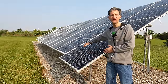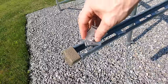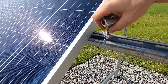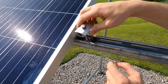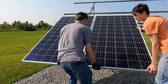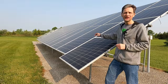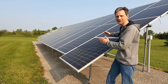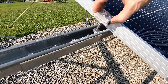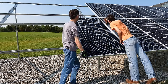To start setting your panels, confirm your available linear feet of racking by adding up the total width of all of your panels plus the fastener gap between them. Make sure you have an additional two to four inches at each end for the end clamp. Start two to three inches in from the end with your first panel using the end clamp assembly. Set the panel as parallel as possible with your east-west purlin. If you find you're starting to track slightly off, don't go back to the beginning — make a small 1/32-inch or 1/16-inch gap at the top mid-clamp to make a small correction. Your goal is to move back to straight; don't overcorrect or you'll chase a wave up and down. Once the first panel is set, place the spring-loaded mid-clamp next to it, set the next panel matching the bottom, push it up against the first panel, and tighten the bolts. Work your way down to the end and complete the row with another end clamp assembly.